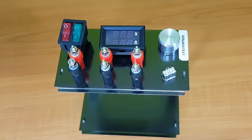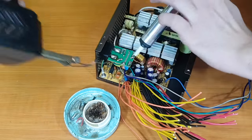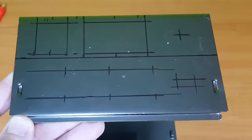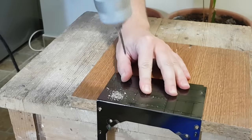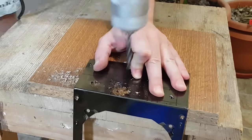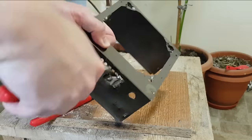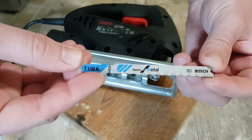I need to fit all the parts on one side. The rocker switch will be mounted too close to the AC circuit board, so I will unsolder it from the AC connector and solder it back a few millimeters lower. I've made a simple schematic on the side of the case to know where I need to cut it. When drilling holes in a metal sheet, first drill a smaller hole, then enlarge it with a bigger drill bit. For the wattmeter rectangular hole, I tried drilling a lot of smaller holes then cutting the remaining metal with metal cutting scissors, but this takes too much time. The correct way is to use an electric jigsaw with a good quality blade.